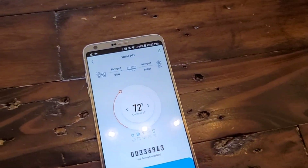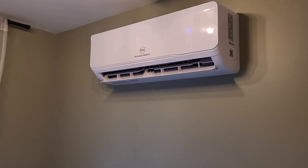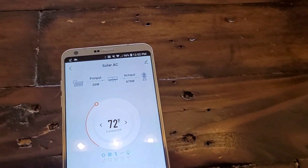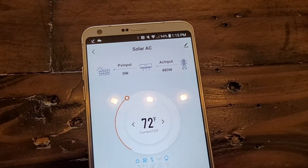On a day like today it's going to ramp down a little more still. If it was colder out it would probably hold right around 660 watts. On a day where it's a little bit below zero it tends to hover around the 600-watt mark and just run there all day long. A day like today I think it will continue to drop probably into the 400s.